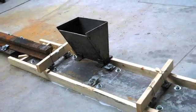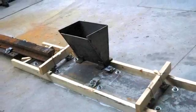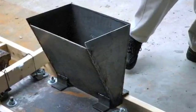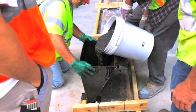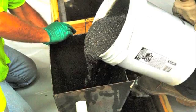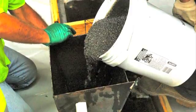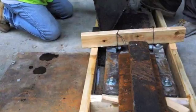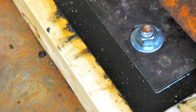These head boxes, a form of a hopper, will be used to dispense the mixed self-leveling epoxy down under the base plate. The self-leveling epoxy will then move under its own weight, filling the space under the base plates and filling all voids. The rounded silica used in the Surepoxy aggregate allows the self-leveling grout to move more easily than an aggregate with sharp edges.